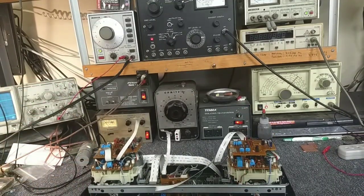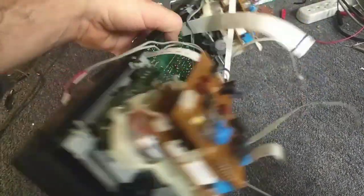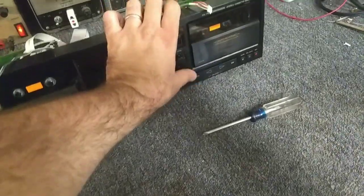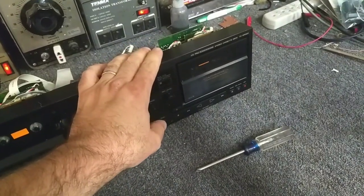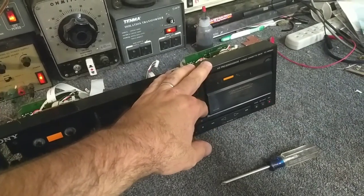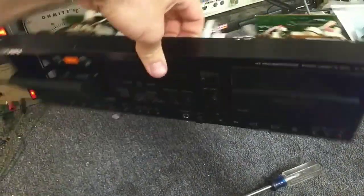To get the transports out, you have to take the door cover off. This one ejected easily, but if it's jammed and doesn't eject - for God's sakes, don't pry the door open. Don't do that. I get so many of these in where people grab a butter knife and break something inside the transport. If this is stuck in a cycle and you force the door open, you'll destroy the head block and pinch rollers and render this a useless transport.